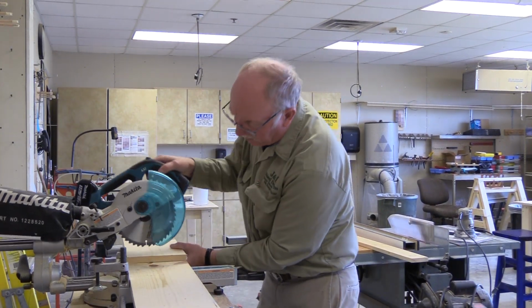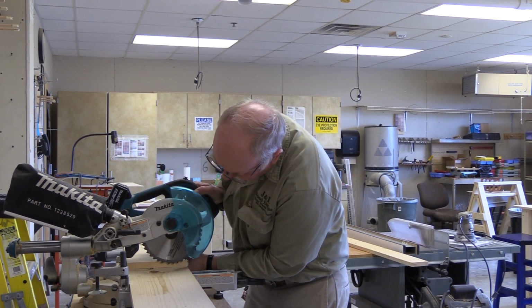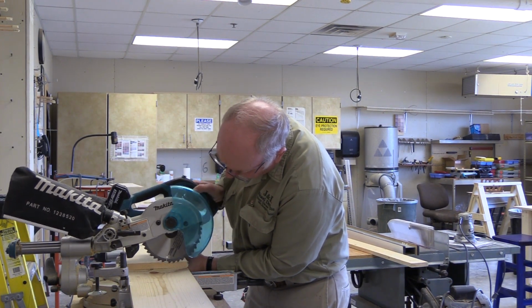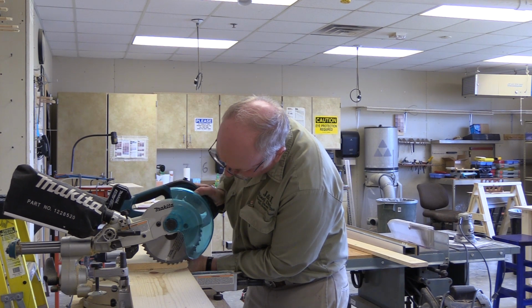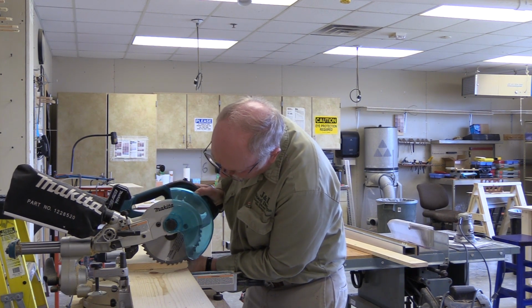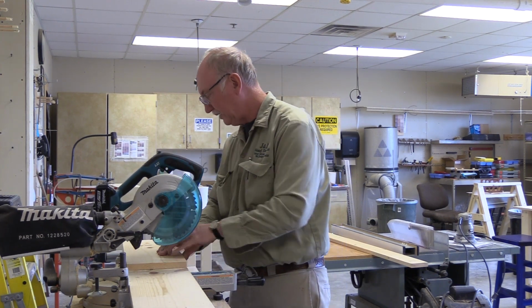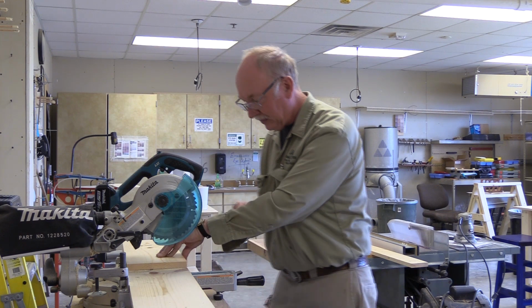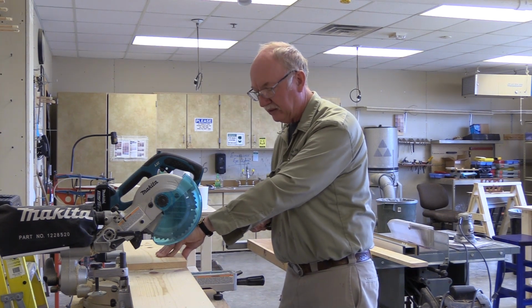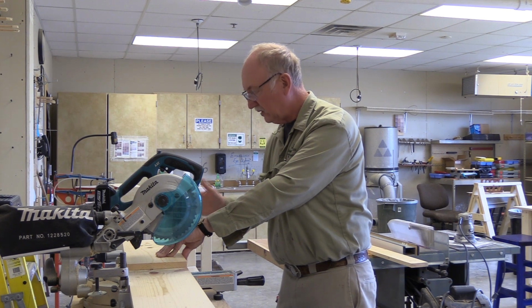And then when you bring the blade down a little bit, you can bring it down until it just barely touches. You should feel next to no resistance on this top piece. I think you probably see where I'm going with this. If you do it this way, then the 2 pieces will be absolutely identical in size. And that's really the most critical thing. You just want your pieces to be really close to the right size, or the same size.